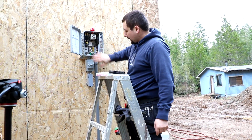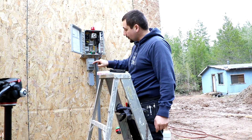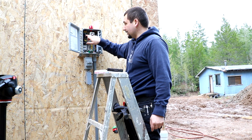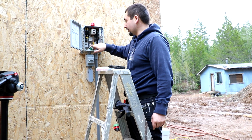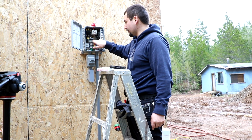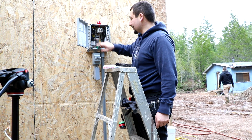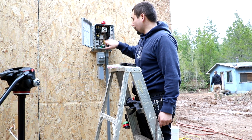I've finished wiring up the panel. The power comes in from the junction box down here. We'll put siding around this and I'll put a block of wood behind here shortly. It goes to a power cutoff switch that supplies power to the pump, and there's a separate wire that supplies power to the panel. So pump supply goes to the control board — pump supply is one and two, and panel supply is three and four. You just plug those wires in. Pump supply comes up and goes to the breaker, the breaker then jumps back over to this solenoid, and the solenoid runs down to the pump. My pump is here, so we've got hot and neutral, and everything is grounded to the board.